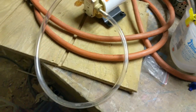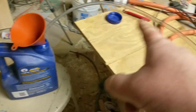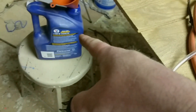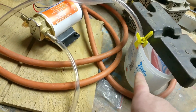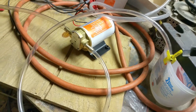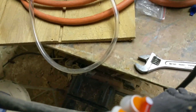We're pulling just through this flexible oxygen tubing here, but it should be good. I'm about to plug it in — it is not primed though. I did do a quick test a moment ago with the container at a higher elevation than the pump, a gravity feed kind of thing, and ran a full bunny bucket of clean motor oil through it. I didn't want to try and pull a vacuum to suck without making sure the little brass gears inside were properly lubed. Here we go.